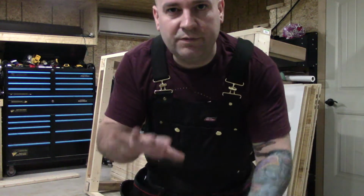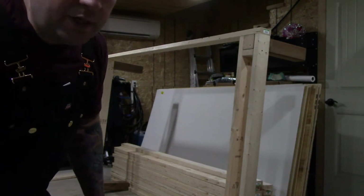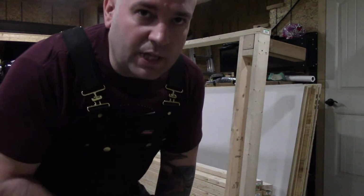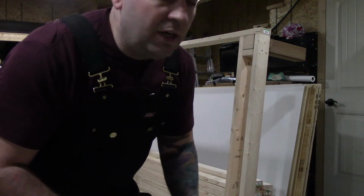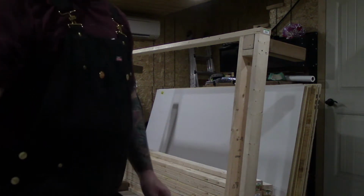At least for the unevenness of the floor, I'd like to have it stood up there like I do now, make sure it's flush, tack it in place, and then when it comes to actually putting in the lag bolts and drilling the holes for that, I'll know that everything's already set in place. So let's get through that.